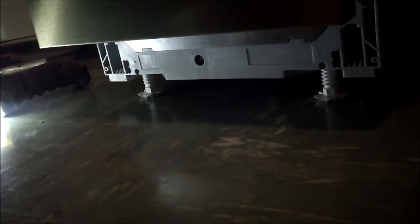Probably need to re-level this because we've got a little lip for our underlayment up top. Our underlayment down here under this green tile is going to upset this leveling process, because I think the rear single leg is probably sitting lower. The bubble is good up here on this level, so we'll start with that. And we can re-level it. Probably what we'll do is we'll level the front of the door. Since we've got this remote leveling gizmo built in, let's see how this slides in there.